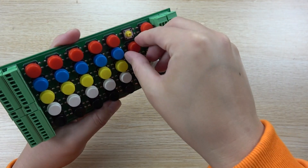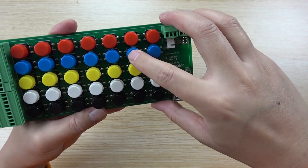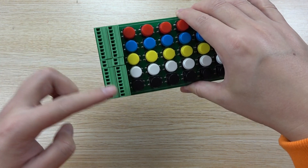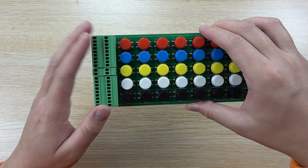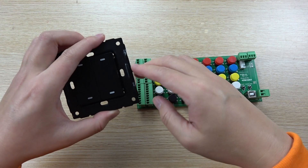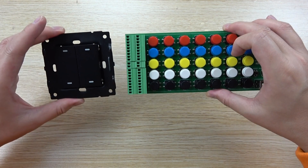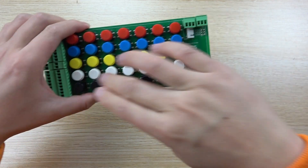You can install the color caps back to the switches. There are 35 channels of buttons, but the terminal has 36 channels for digital input — the 36th is an additional external digital input. You can connect any dry-contact momentary switch to this terminal, supporting a total of 36 buttons. This is the front — the terminal side for the switch and the keyboard.